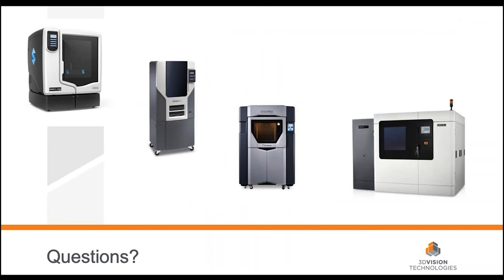Let's open it up to questions. One question: how much does it cost? If a part costs $500 to print in FDM, you can roughly double that — so a typical part would be about $1,000. You can either use a soluble material and dissolve it out later, creating a metal shell with a hollow interior, or leave the plastic in there as that composite material.